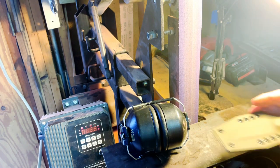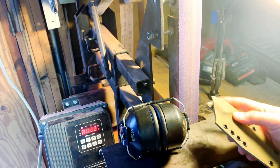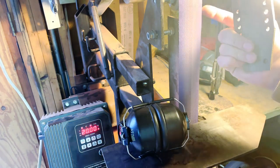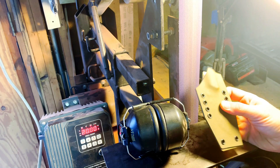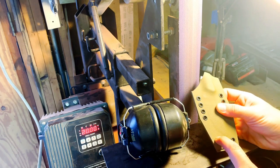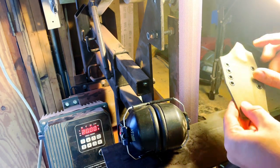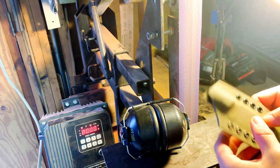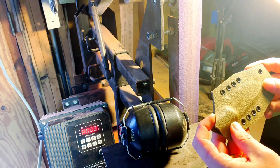This kydex sands down pretty easily. I'm starting with a 120-grit belt — something a little older, not brand new — and these belts last a good while when you're using them for this purpose. We just want to get really close to our guideline but not right on it, just in case.